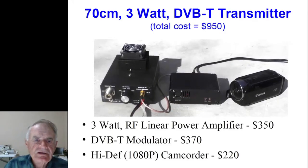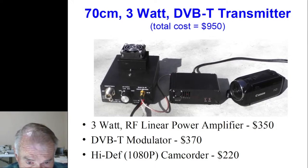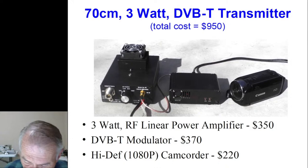Here's a whole TV transmitter setup — exactly the kind used by the Boulder County ARES group. They've been using television successfully for many years in support of the Boulder Sheriff, police departments, and fire departments in Boulder County. They have four of these systems set up in backpacks for portable operation. The camera is on the right, the small box in the center is the modulator, and on the left is a power amplifier putting out three watts. You're basically looking at about a kilobuck to get into a transmitter. Receivers are going to be a lot less expensive.